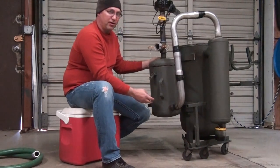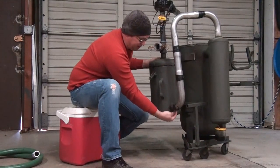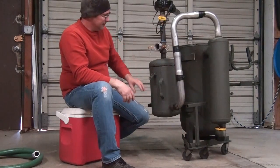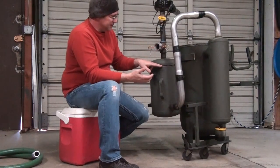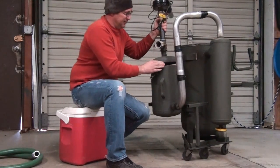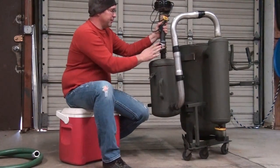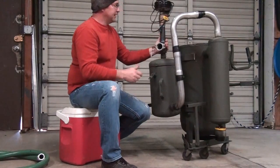This pipe goes into the bottom of my filter. You can put straw in here, sawdust - Josh uses just sawdust. I have a combination: sawdust, straw, and a couple of rags. The tube that goes in the bottom has a bunch of holes drilled along the bottom, just like in Josh's video. It slides all the way in to the end and is capped off, so the gas comes out and filters up through the filter media. This was a little air tank - I cut the top off, made a flange with two donuts welded in, used silicone, and put some latches on it. That's my filter.